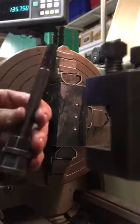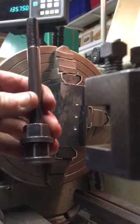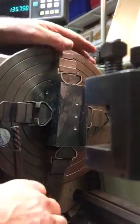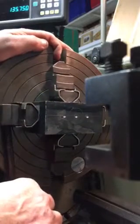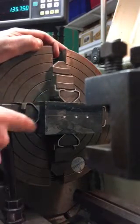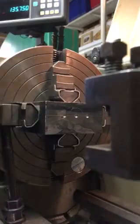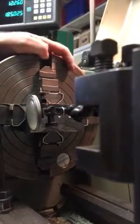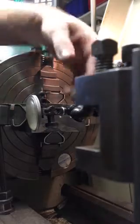This is the main setting tool — it's just from a clamp kit with two locking nuts locked together. It can be placed onto the bed of the machine so the chuck jaw can come round and return to the same position each time. I put my magnetic holder onto the tool post with the clock, and then I move the clock roughly onto the centre line. It doesn't have to be exactly on the centre line because it's going to come back to the same position every time anyway.